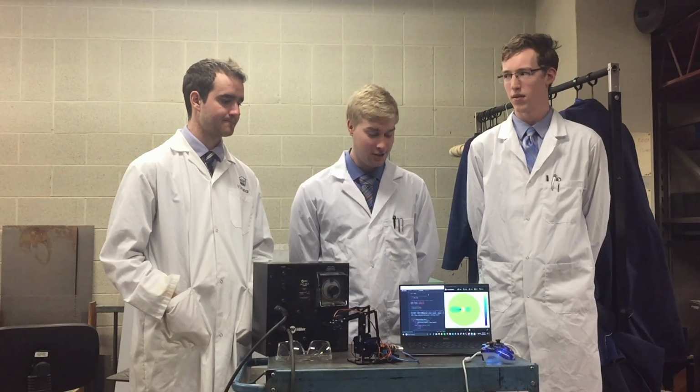With no limitations, the robot has full range of movement as allowed by the servo motors. Each servo only has a range of motion of 180 degrees, but this can be adjusted by calibrating them and adjusting the starting position of the robot. However, there are still physical limitations when giving the robot a full range of motion. This brings us to possible errors that may occur in the operation of the manipulator.